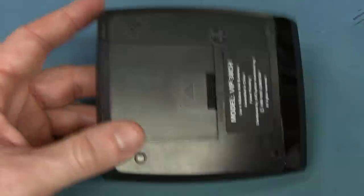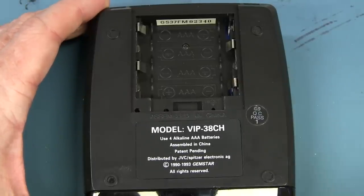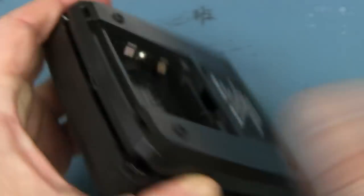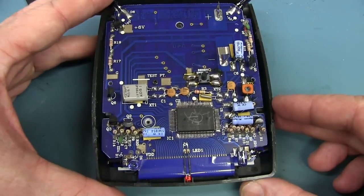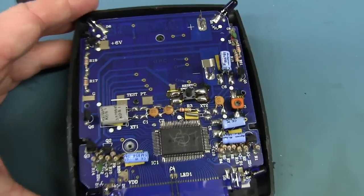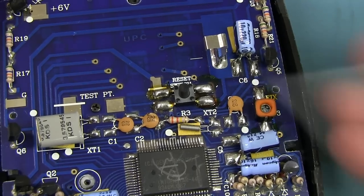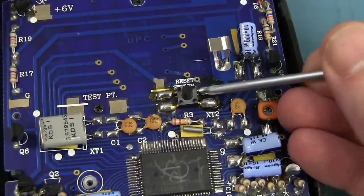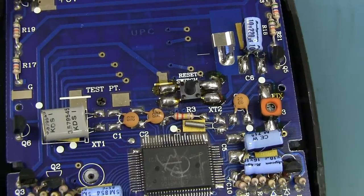We'll do a very quick teardown. 1990 to 1993 Gemstar. And it's one of those annoying press-fit cases — I'm just going to be brutal with this thing. I finally got the thing open. Look at the bodge soldering on that! They've converted what looks like a through-hole tact switch into a surface-mount tact switch. Look at the flux residue around that and the amount of solder — that is just truly awful.